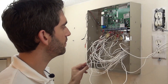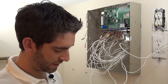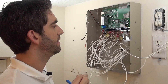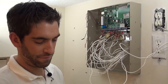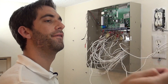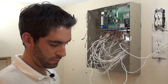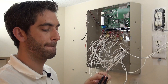Actually, let me correct that. Zone 2 is shared with Zone 9, Zone 3 is with 10, Zone 4 is with 11, and Zone 5 is going to be with 12. Cut off our resistor, strip our wire, connect in our new resistor — 6.2K value.